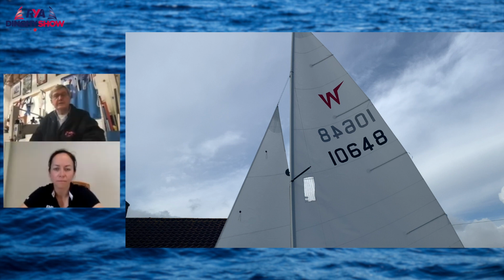If we bend the mast like mad, look what happens. Can you see that the luff curve, the positive round, is being used up and it's starting to crinkle up? Well, that's unsightly. Doesn't look good. And this is where, in my sort of boats, you need to use the Cunningham. In other boats, your single-handers, your fully battened big boats, it would be slightly different. But in my sort of boats, the Cunningham is a tidying up exercise after you've bent the mast and organized the kicker to make the mainsail just on the point of backwinding in the W panel, or the Albacore panel, or the Osprey insignia, or whatever.